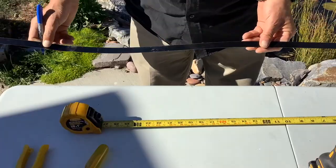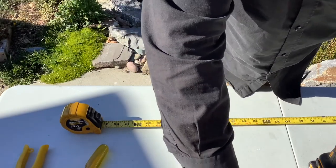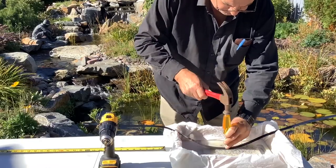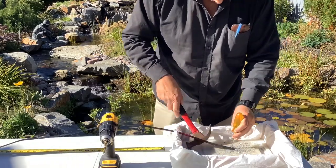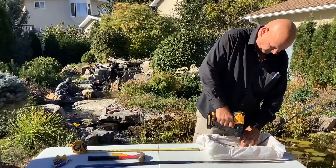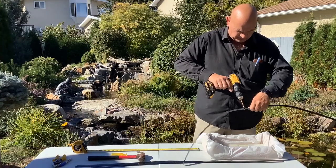Once I've finished getting the four straps, I'll remeasure to find the center, which should be 22 and a half inches. I'll mark that center piece and then mark from each end another half inch to three-quarter inch for another drill hole placement — so there's one in the center and one on each end. I'll drill those out; sometimes I use a punch to help so the drill bit doesn't slide all over the metal. When drilling, don't go too fast — start fast to get a pool of metal shavings, then slow it down so the torque of the drill doesn't spin it around on you.